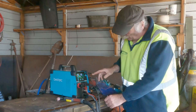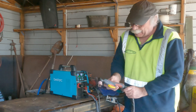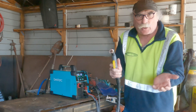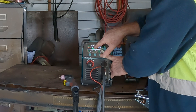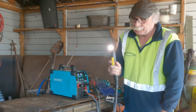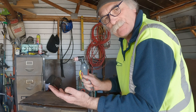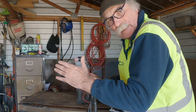Now if we set the PA — we've got it at one second at the moment — let's turn it up to two seconds. Look what happens when I pull the trigger. About two seconds, the flame comes out and then it stops. Now if we go back to PA and turn it up to 10 seconds, let's pull the trigger and see what happens. About 10 seconds, guys — I've still got my trigger pulled here. See that? But it stops. So it went from one second to 10 seconds, and it gives us a variation from one second right up to 15 seconds.